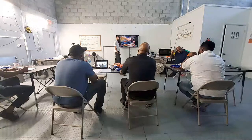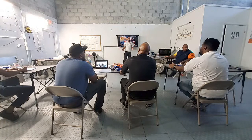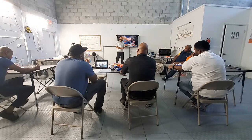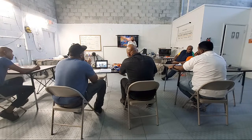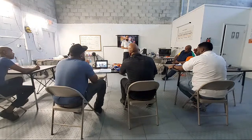So let's perform that sweep down there by the compressor. We did it yesterday for the high and the low. It's good that you don't remember, because your brain will fail you. Writing it down will never fail you. If we want to do that isolation test, or we want to flush our low side out from the rear, what pieces of copper tubing will we remove?